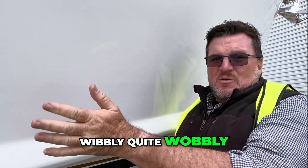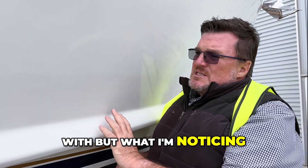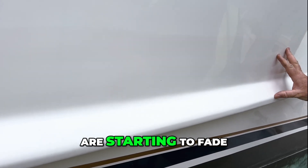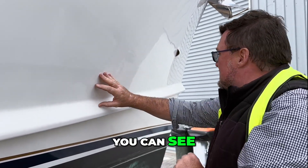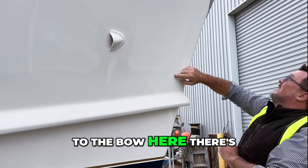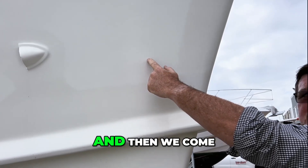Looking down the side of this boat, it's quite wibbly and wobbly — maybe pulled out of the mold too early, or just not a true shape mold to start with. What I'm noticing here, which is hard to pick up on camera, are two very different colors of gel coat. I've known this vessel since it was brought here new. I couldn't see this to start with because the colors kind of matched, but as the boat's getting older and the gel coats are starting to fade, these color variations are becoming more and more prominent. You can see a clear line here around this area where they've glassed on this clamshell water outlet, and then up toward the bow there's another fade line.